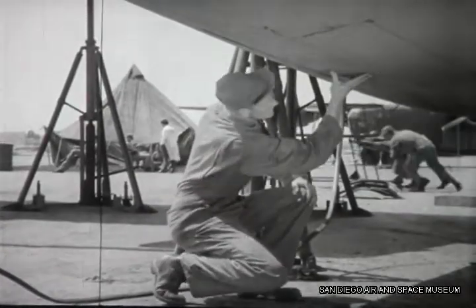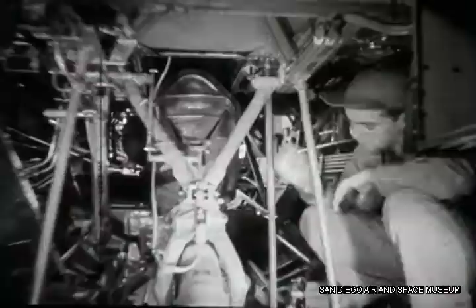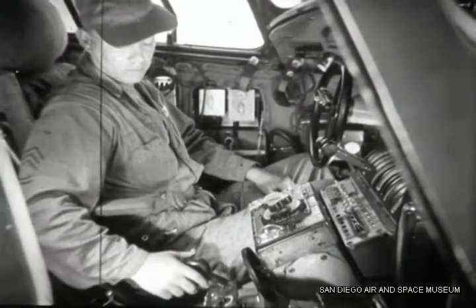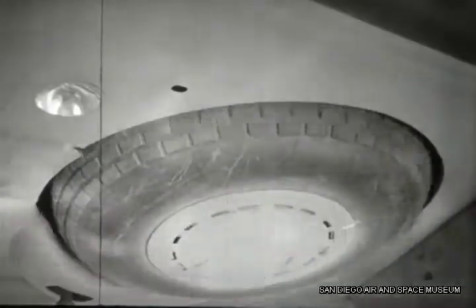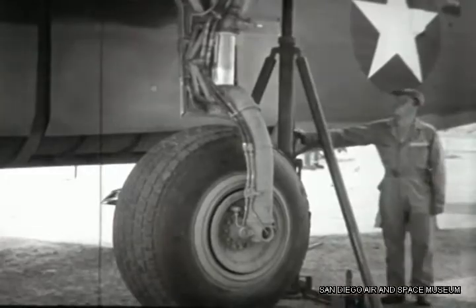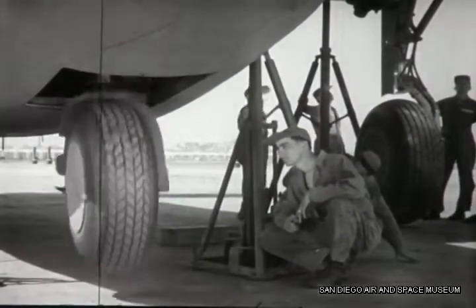Then the fit of the fairing is carefully tested. The fairing of the nose wheel is checked from outside, while at the same time Williams examines the nose wheel lock from within. After a signal that all locks are working, he lowers the wheels for the next check. Down they come and lock in place. The nose wheel follows in sequence, and the green light goes on again.